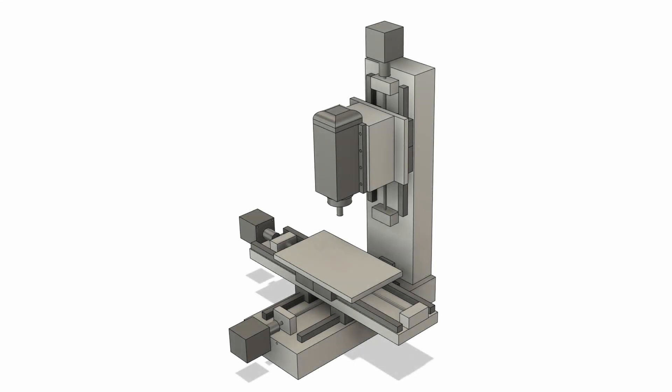This video is about squaring up and tramming a DIY CNC mill. A lot of the information you can find online about tramming mills is focused on mills that people have bought and then need to tram. For those types of mills you have some sort of guarantee that the manufacturer has squared up the mill so that the axes run perpendicular to each other, and the tramming you're doing is just making sure that any adjustments have been correctly squared afterwards.